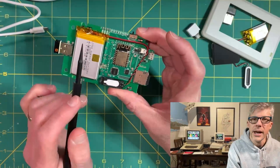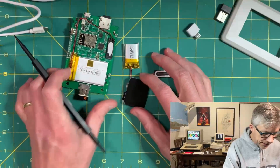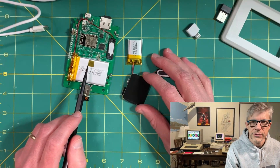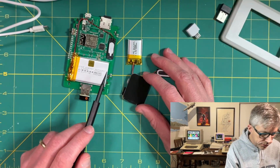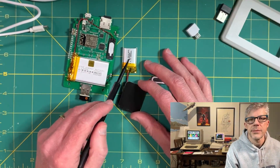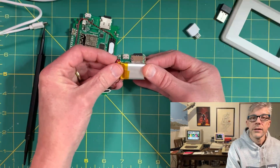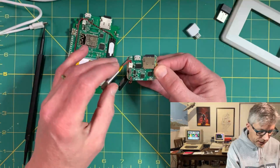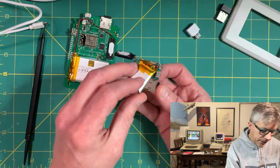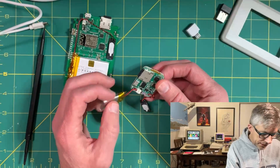There's no harm if you get them backwards — it just won't turn on. As far as battery power goes, if you get a small battery, it's not going to last as long as the larger one. Here I have a 500 milliamp hour battery, and with this battery I get about four hours of use out of either the 3.2 inch or the 1.6 inch. On the little 1.6 inch, I have a 250 milliamp hour battery, and this seems to last about an hour and a half. So in hindsight, I probably should have just gotten a bigger battery. I think I'd actually rather get one that fits the entire size of the 1.6 inch emulator so you'd get a little bit more life out of it. The battery itself doesn't last a long time, and under heavy use you'll probably drain it pretty quickly in just a couple hours. But it's easy to recharge.